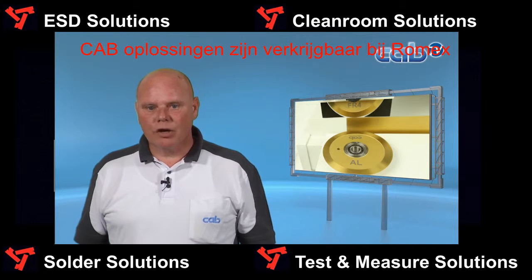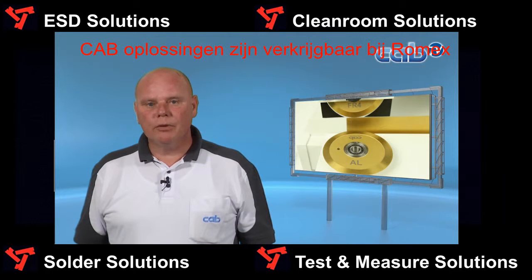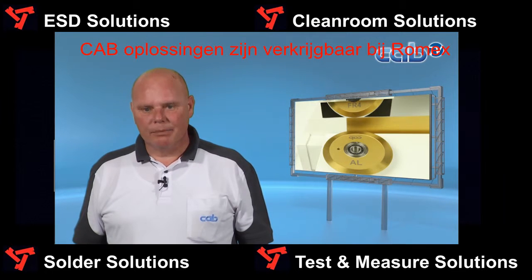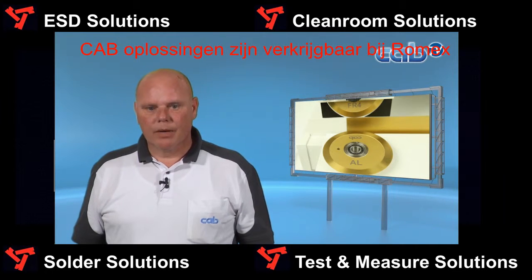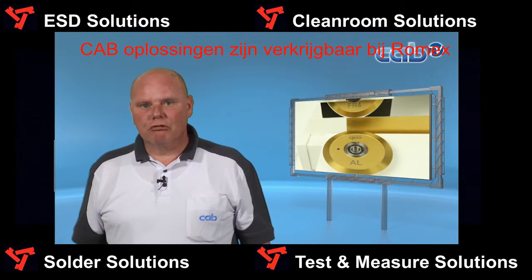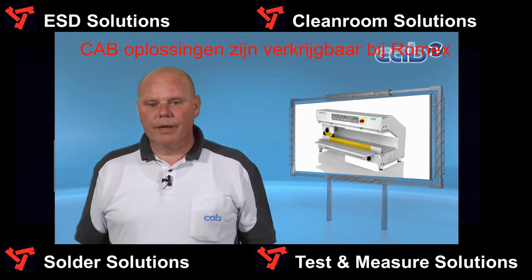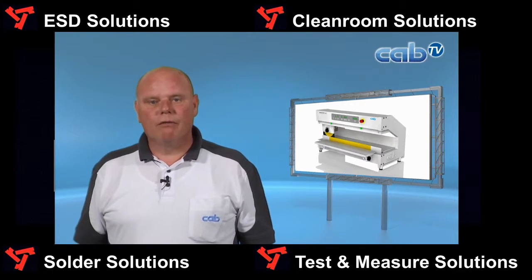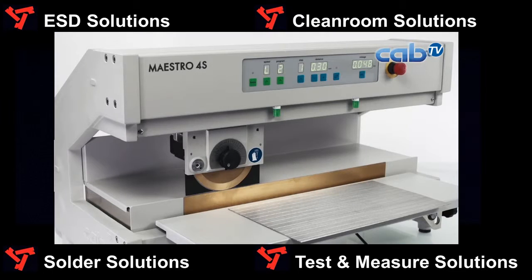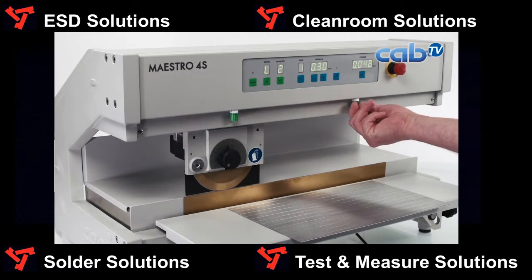Important to know in this context, with a standard roller blade, the PCB often has to be run over several times, sometimes even by both sides. By contrast, there is a bunch of possibilities with Maestro 4S. Combined with a standard roller blade FR4 and with a special adjustment, the Maestro 4S can be used for various alloys.